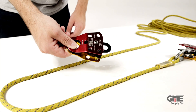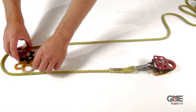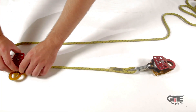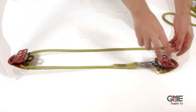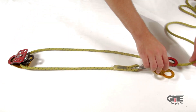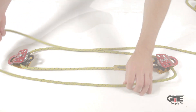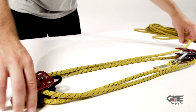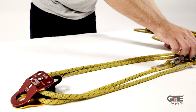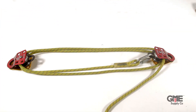Now, let's take the other double-sheave pulley and position it here facing away from the first one. We'll start rigging it from the bottom, so open it up, run the first length of rope through, and once you're through, you can go ahead and close that side of the pulley. For the next step, we'll take that rope back up to the first pulley and run it through the bottom as well. You want to make sure that your pulleys are laying on the same side, so you can go yellow to yellow and red to red. This will just give you an extra point of reference to assure that it's being rigged correctly. Go ahead and finish running the rope through the red ends of the pulley, and now you have a basic 4-to-1 system.